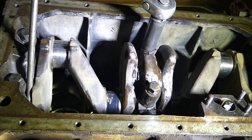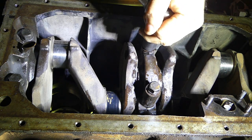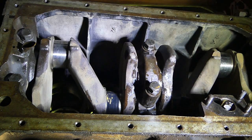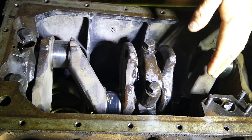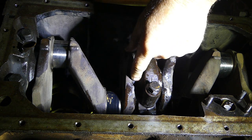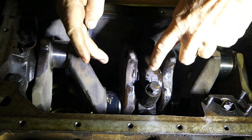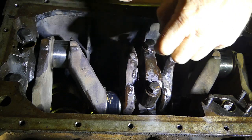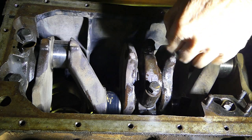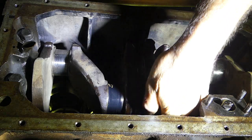Now this needs tensioning. I haven't got my tension wrench under here, so I'm just going to nip it up for the moment. Now we know that our back thrust surface, which gets all the drama when we push our foot on the clutch, is supporting the crank on a full surface of thrust washer. That's what I'm trying to get through. So probably the front here has just become even as well. We've done our thrust washers.